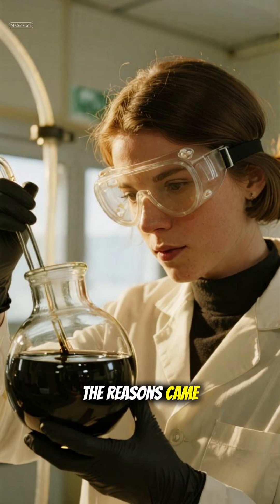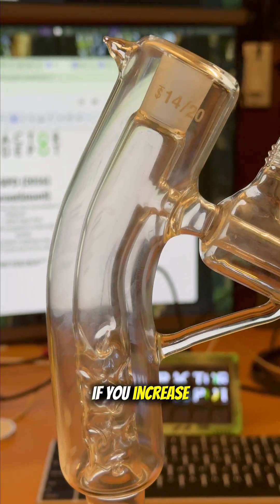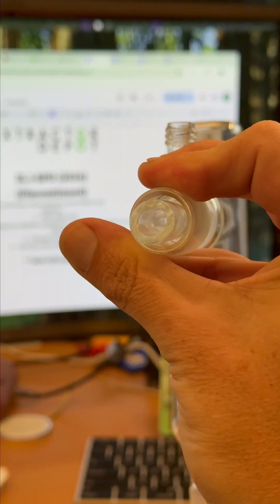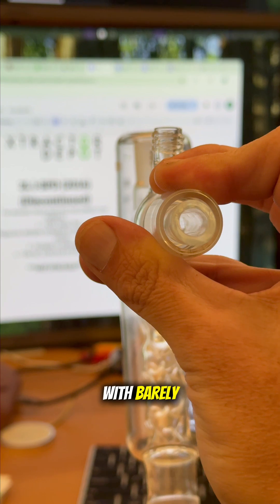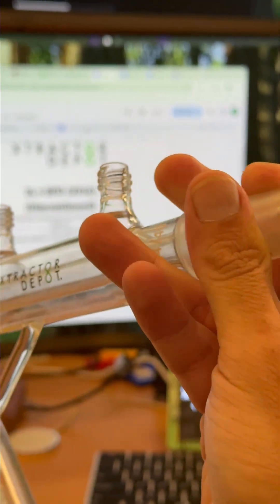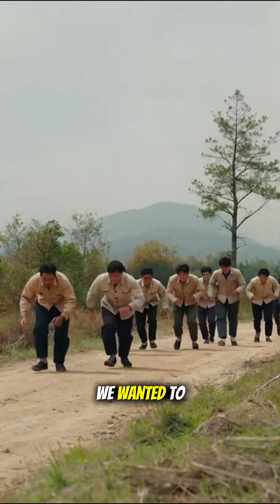The reasons came down to design: a narrow column that flooded with reflux if you increased throughput, a bent neck that restricted vapor flow, and a condenser with barely 14mm tubing that bottlenecked the vacuum. Together, these limits kept us crawling when we wanted to run.